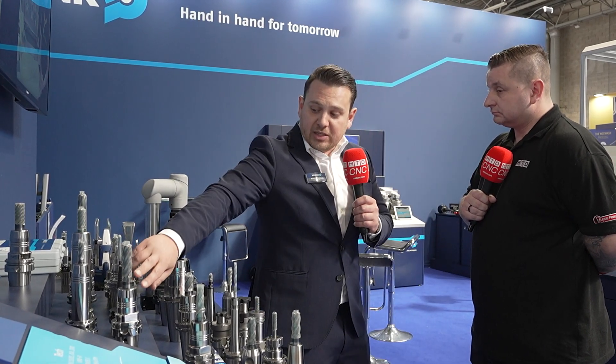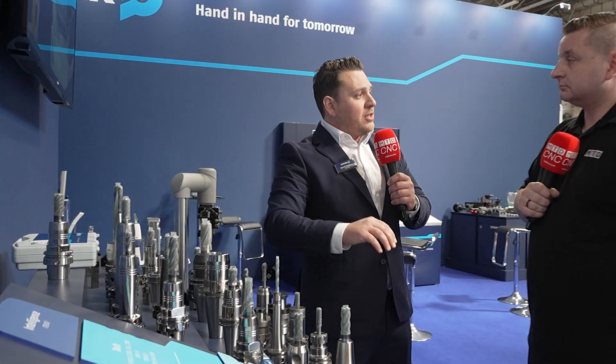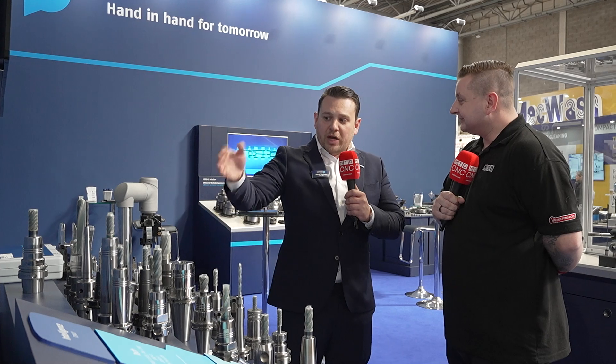What we have in here are some very cool features. We have a new hydraulic tool holder that is a direct replacement for heat shrink, which brings you all the hydraulic advantages with the same profile. And on the very top we have the iTendo, which is our crème de la crème hydraulic holder with sensors inside for doing very sophisticated machine-monitoring analysis.